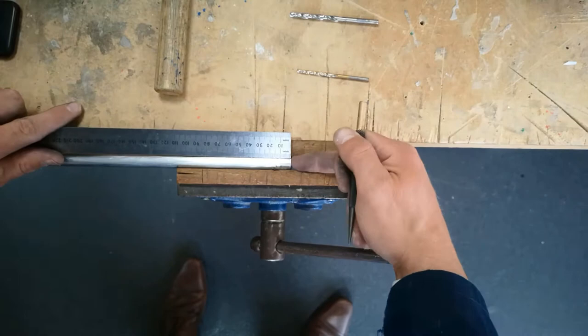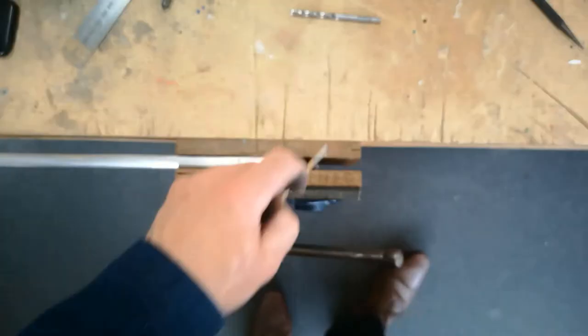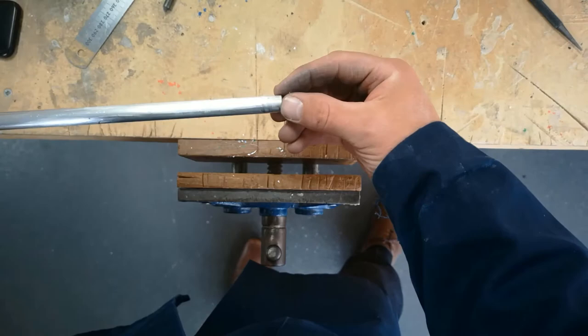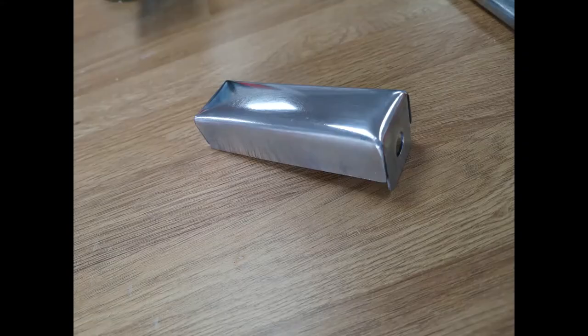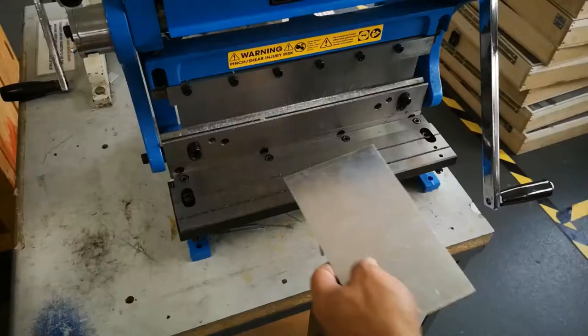Process number 12 is drilling the hole for the cable. This is drilled into the plugged end of the top arm, 50mm down. Centre punch and make a very minor dent, then get a 4mm drill bit and drill into one side of the wall, then widen that hole with a 5 or 5.5mm drill bit. Lightly file any burr off, then sand with 240 up to 400 grit to prevent any sharp edges touching the cable.